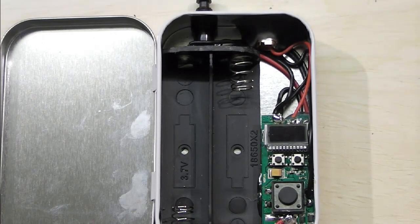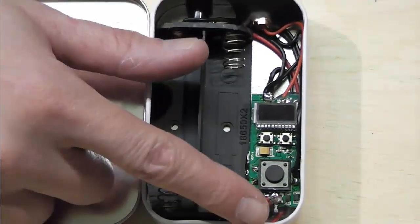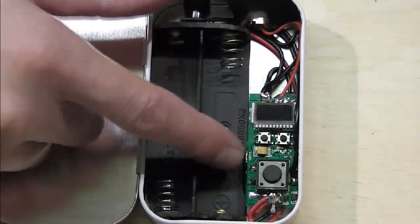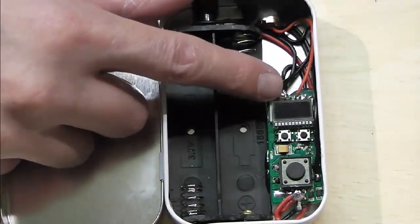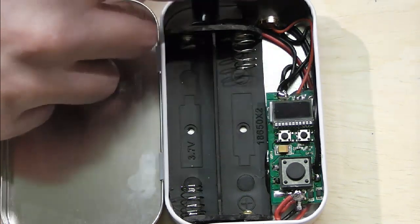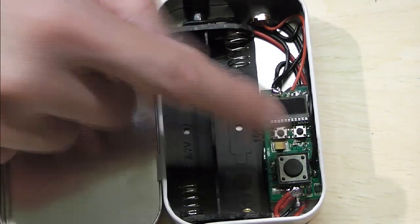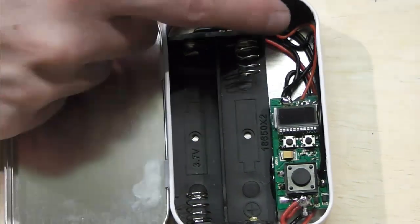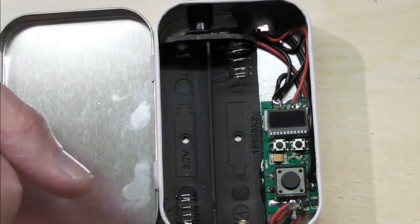Right, well, I actually took the liberty, because we all know how to solder an atomizer connection. It was just a case of those final two connections. So effectively all we've done, we've taken our positive feed from the positive, both sort of compartments here, same with the negative. We've wired up our negative out to our atomizer and our positive out to our atomizer. And we've just taken a bridge across a switch there and gone to an external switch up here. And I've just put a bead of epoxy round inside there to hold that in place. Effectively, that is this one done.